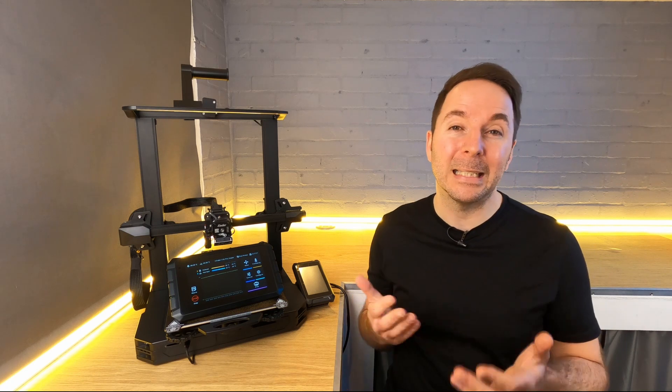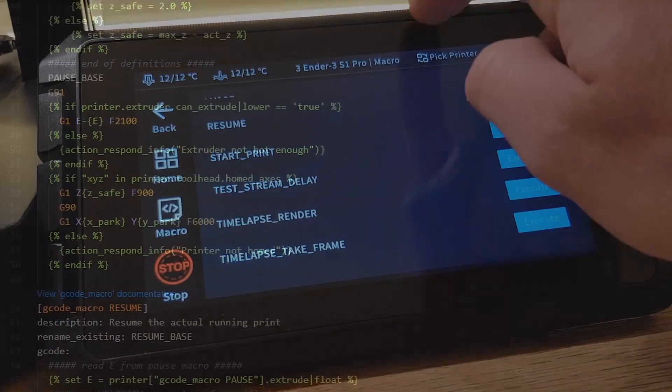As you've probably picked up on, there are a lot of different variables that can affect Pressure Advance. To have your printer running at its optimum you'll probably need to repeat this test if you change any of the major factors that influence it — this could be a change to the input shaper tune, a change in any components which affect how filament is extruded, or even the filament itself if you really want to dial in a perfect tune. In the next video of the Intermediate series I'll show you how to use macros to streamline some processes and save some time — click the link to go to that video now.